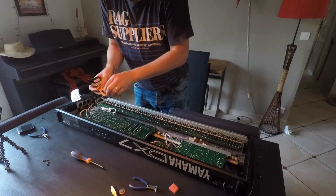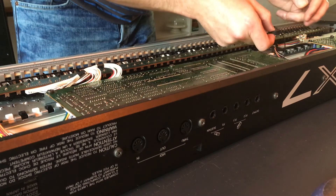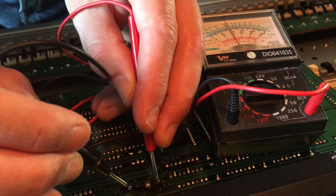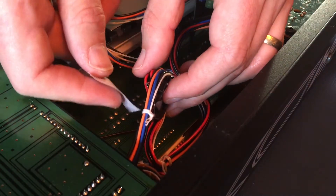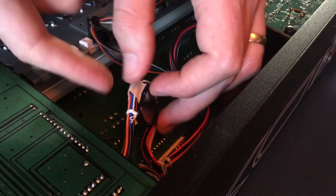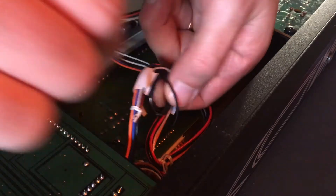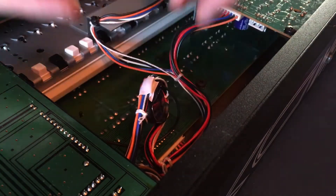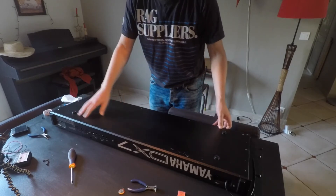Now take out my battery — I've got a multi-pack of these CR2032 batteries online — and clip it into the battery holder, which is just freely floating around at the moment. Push that battery in. Now's a good time to check we've got the correct voltage: you can see the positive and negative, red is positive, and the reading goes up. I found a neat little place in a current wire loom to just push the battery holder in, and I'm adding some insulating tape to hold it — there are probably better ways using cable ties, but this is good enough for me.